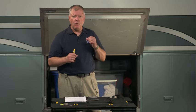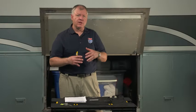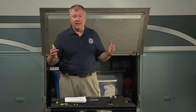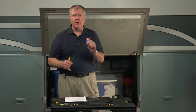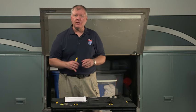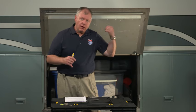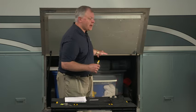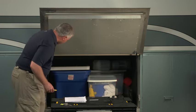I'm going to find out which outlets are hooked to the Ground Fault Circuit Interrupter — the GFCI — inside. Normally in a motorhome or travel trailer, there will be one GFCI inside, usually in the kitchen or the bathroom, and then there's a series of other outlets that are ganged to it or connected in series. So if that one outlet trips, all of them go dead. It's a little deceiving because you don't see a reset button on the other ones.